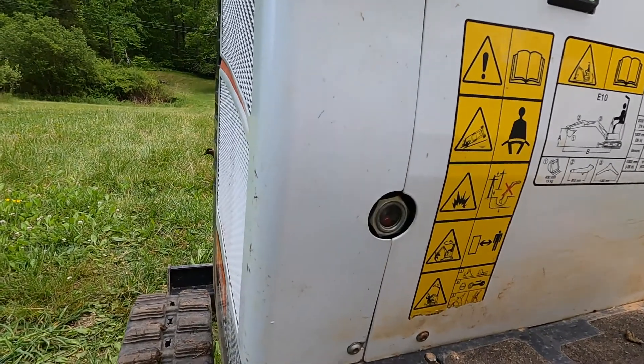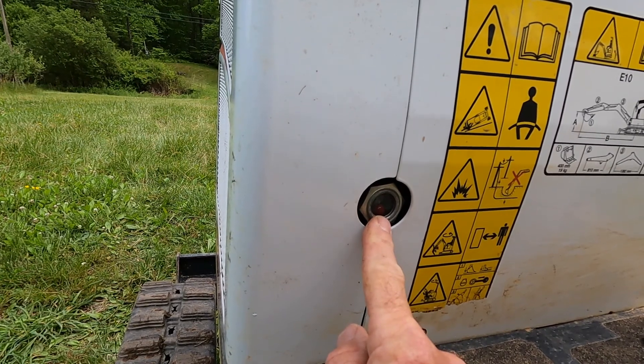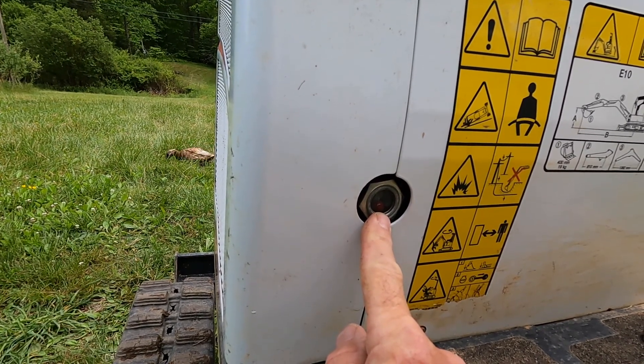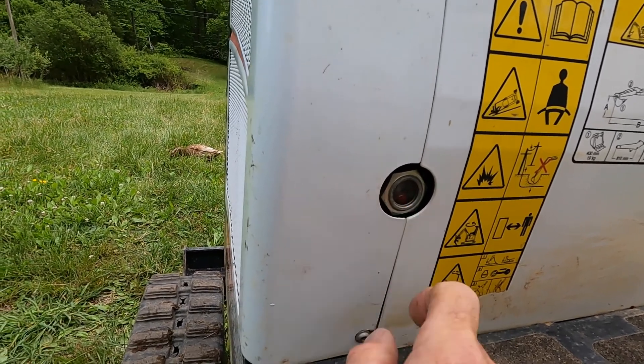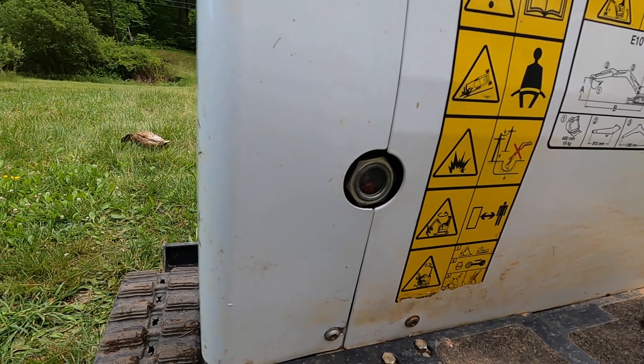On the front of the machine there's a little window with a ball in it — this is the hydraulic level indicator. When the boom is in a certain position with everything closed and curled, this little ball should be floating right in the middle of the window. You have to refer to the owner's manual for that; it's a bit complicated as you have to get the boom in exactly the right place for it to be accurate. Well, that's it for operating the Bobcat E10 — those are just the basic levers and pedals you need to know to operate it safely. I hope you enjoyed the video. If you liked it, check out my other videos on my channel, give me a thumbs up, and leave a comment. I like to hear your questions and comments — hope to see you next time!